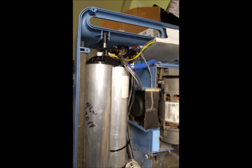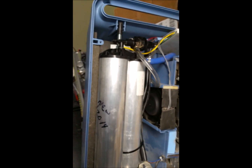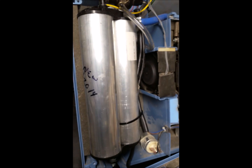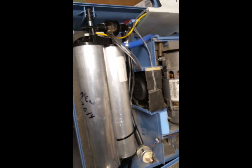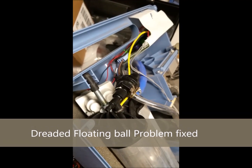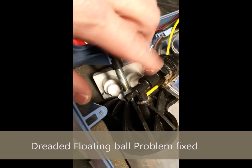This other machine is being cannibalized for parts because it's just too dirty. I'm going to throw the rest of it away but go ahead and cannibalize the parts to be used on other machines. If you have any questions, feel free to check out hellstarhc.com and look at some of the other videos — they'll cover different things. But this is the most common problem: that floating ball. It's because of that valve housing — it's got dirt in it.